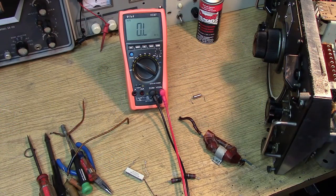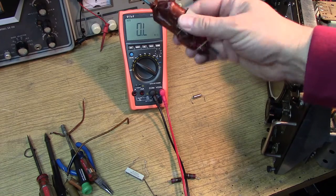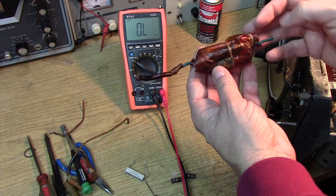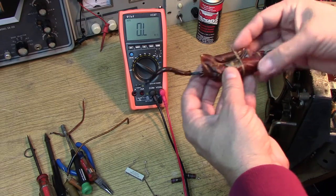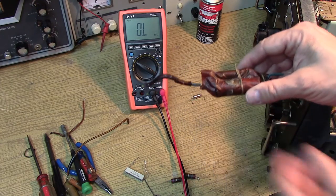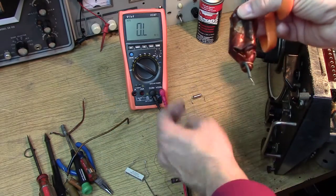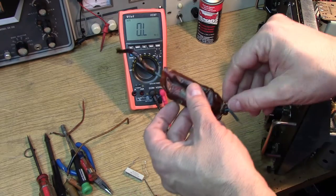The 6V6 audio amplifier that was put into the set had to have a cathode resistor and capacitor to set the bias. And this monstrosity represents what they put in there. This is fish paper, they call it - a kind of waxy, oily paper insulator. And look at this neat tying here that's been done. Somebody was a Boy Scout or something that put this together. This is very impressive. Let's cut into that. This goes well beyond ham radio into the realm of artiste.